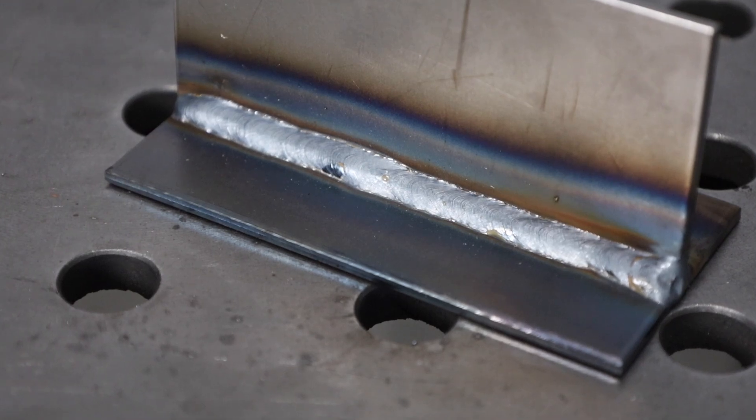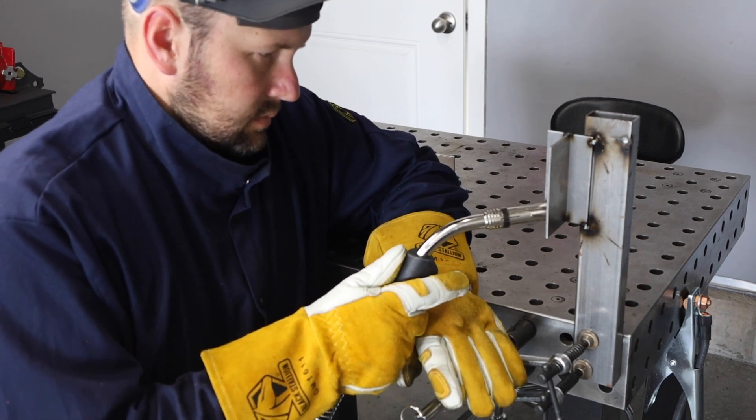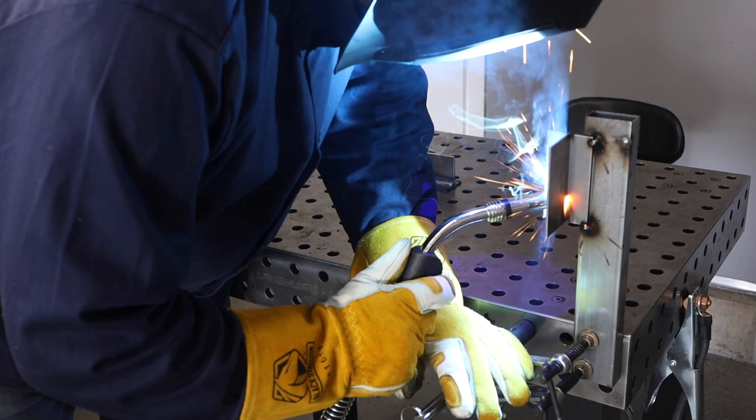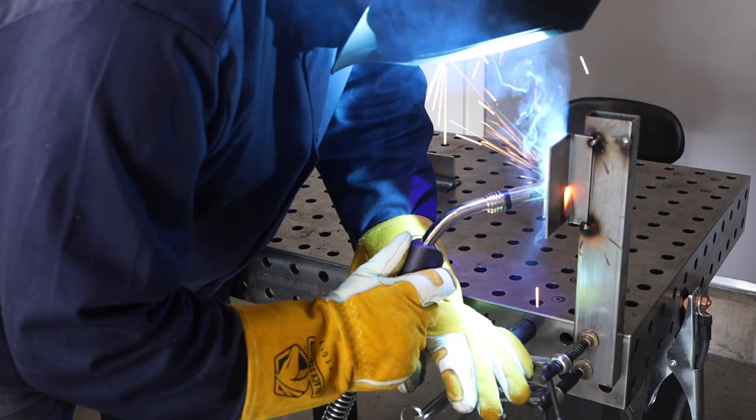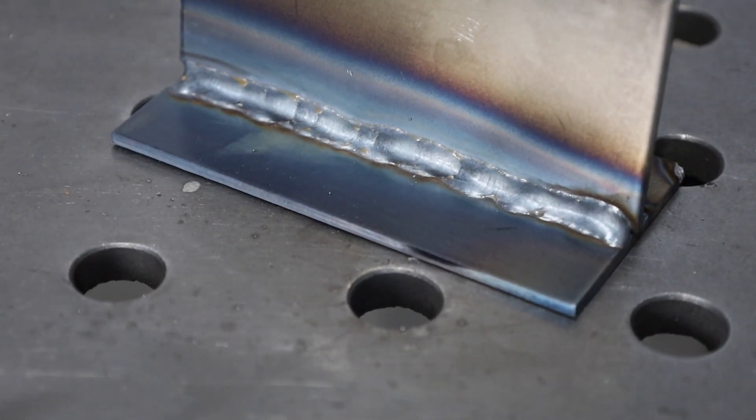So let's try those same settings and a very similar technique with one slight change — welding in the vertical position. I've tacked a T-joint up here to weld it vertically and I'm going to make a little dry run to make sure I can make it all the way through the joint. I'm going to be running a slight uphill 15-degree push angle on my gun, which is pretty common for vertical MIG welding. After I run this stringer bead all the way up with those same settings, it's pretty lumpy — really crowned up in the center — and that's the common problem when you run MIG vertically, especially vertical up. I'm going to show you how to correct that.